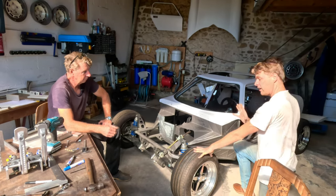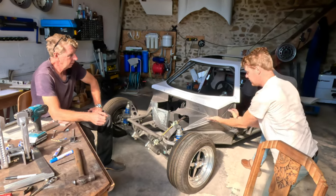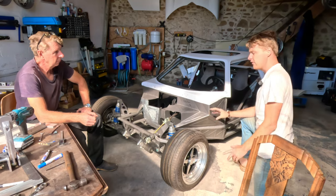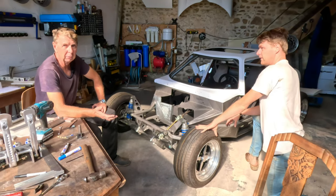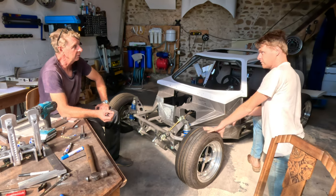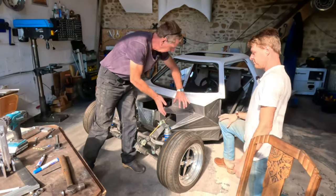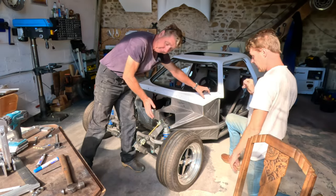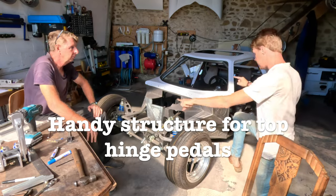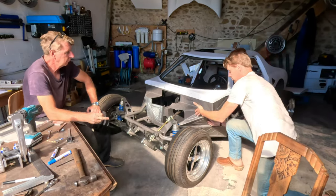But most cars, all your frontal rigidity is in a piece here. Most monocoque cars, it's the thing that they'll brace on an MX-5 when they take them racing. Anything with McPherson struts has to have a big box section there, and a ton of structure here, and a structure here, and it all has to link into there. Yes. But even stuff like MX-5s, they take the wing off and they put a brace on the inside. Now, we don't need any of that. But they've all got a load of structure here.